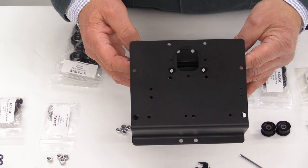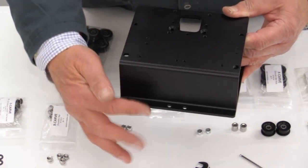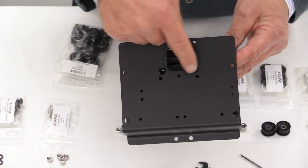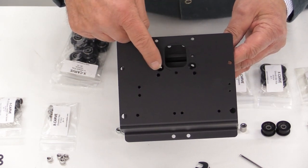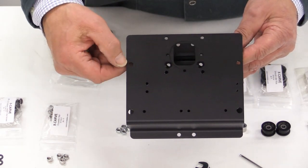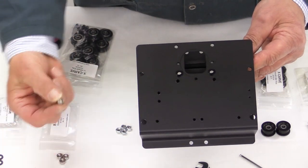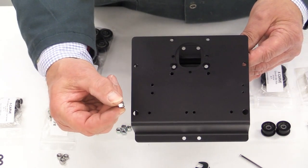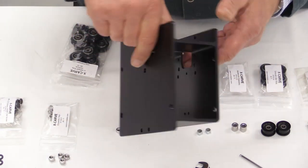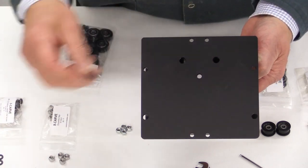This is the X-carriage extrusion, and I want to point out the important parts. I'm holding it with the U-shaped section uppermost and a single flange at the bottom. In the Inventables instruction, the first two screws go through these two countersunk holes for the idler wheels. Around the outside there are four holes in the outer edges — the two at the top are a normal-sized hole for the standard screws, and the larger ones at the bottom are for the eccentric nuts, with the circular part of the nut sticking into the hole, giving you the ability to adjust its position. The same pattern appears on the other side.